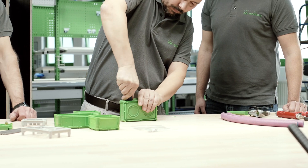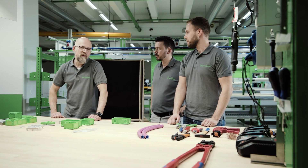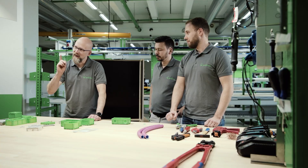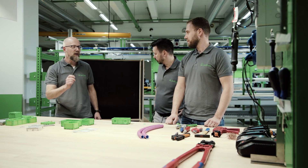We naturally need to further expand the holes with an expansion mandrel. Do you know what kind of nails we use on the working formwork, by the way? They're made from aluminium. Any idea why that is? So that we don't leave any rust in the concrete. That's right! And let's use them now to nail our socket to the formwork.